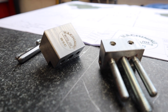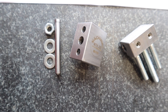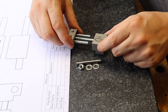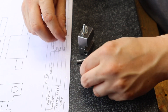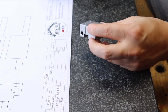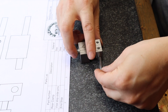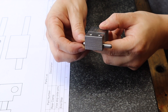Finally we have all the pieces machined to get this thing fully assembled. I just want to take a minute to appreciate this final piece - that surface-ground finish is amazing. Assembly is really smooth: we slide the rear jaw over onto the front jaw and using standard M6 washers and a nut we can secure it together. The bar slides into that reamed hole with a nice tight secure fit and floats around fairly nicely.